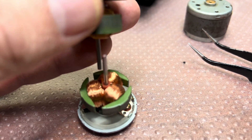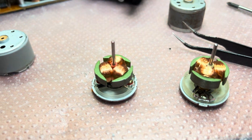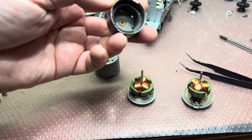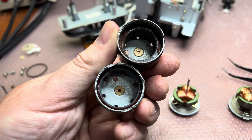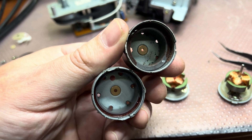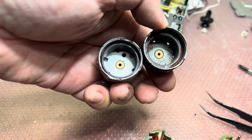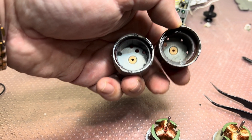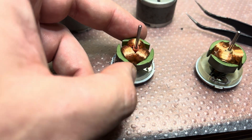As you can see, it's not a big difference, but at the same time it didn't allow me to complete the assembly. Now let me compare the rotors - they look pretty much the same, but the magnets are different. The diameter is different. The new motor has bigger magnets - that's what's happening. Externally they look the same but the diameter of the rotors are different.